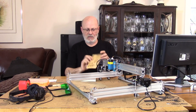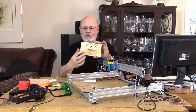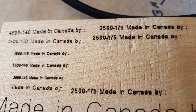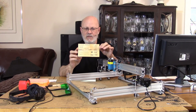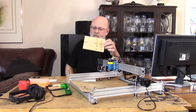If you need to print on wood — this is solid maple, about a quarter inch, about six millimeters — you can get the letters in there. You can go deeper, you can go darker, you can go lighter depending on the adjustments. You can adjust the speed and the intensity of the beam. On this side here you can see a few trials and errors showing what's possible with this little device.